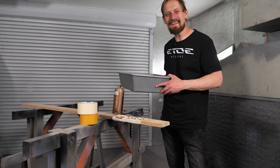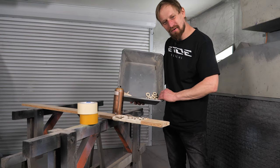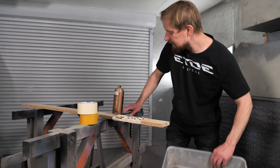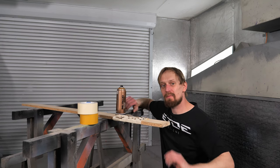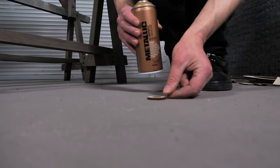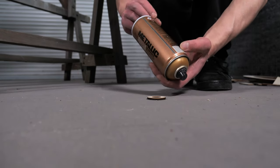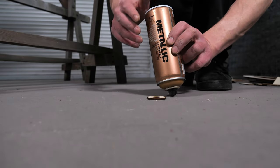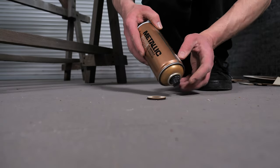For a cool three-dimensional sign it's necessary to paint all the parts cut with the laser. I have a bin with all these small parts and I'd like to show you a cool trick for painting them simply and easily. Use saw horses and a piece of scrap wood. Don't paint these parts on the floor — when working on the ground you can't flip the spray can upside down. There's a thin straw in the can and the aerosols settle to the bottom, so you'll spray only aerosol and no color.